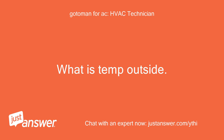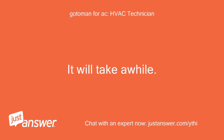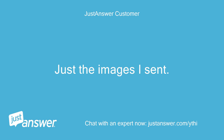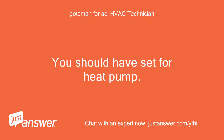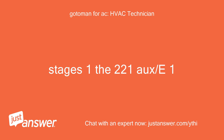What is the temp outside? 24 degrees Fahrenheit. It will take a while. In installer setup 221, did you select O/E number 1? There was no O/E in the setup — just the images I sent. Going through the T5 setup manual, you should have set for heat pump, then gone to setup 221, selected O/E number 1. Go back through, select heat pump, air to air, stages 1, then 221 O/E 1.